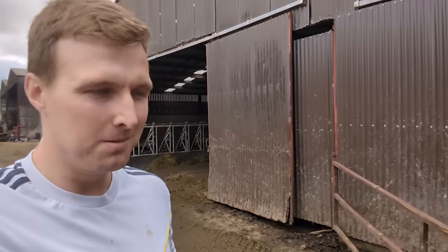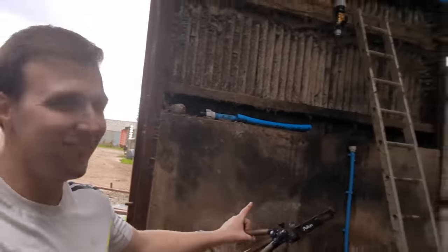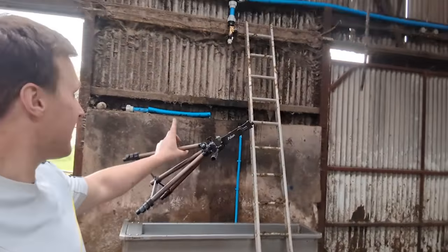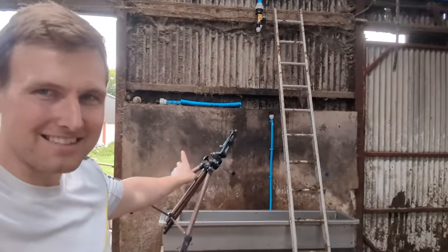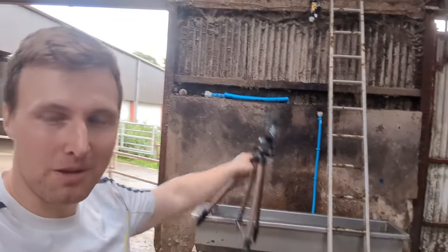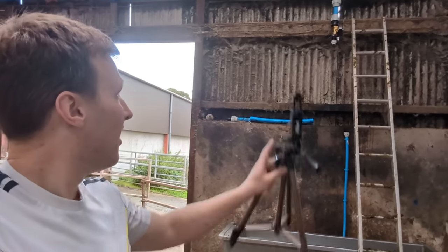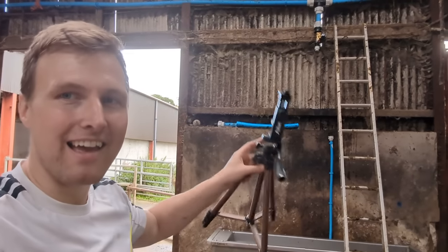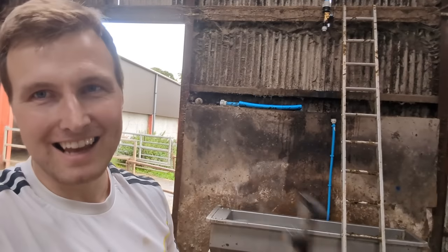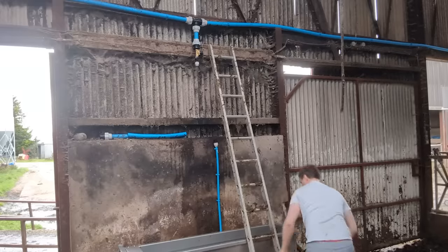Into our second problem. And that is that there is pipes in here leaking. Ow, my knee! Ow. Okay. Oh, that really, really hurt. So you can see where it's leaking. This one's not plumbed in. I'll get to that at some point next week. But these joints up here, they have plumber's tape on them, but they're only hand tightened. So I'm gonna go and tighten them properly. Now, hopefully that fixes the leak. Then we can get to the lab and get some code written, and I'll explain how all of this is going to work.